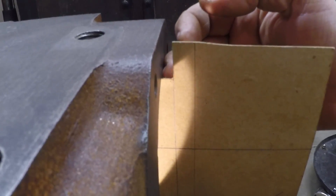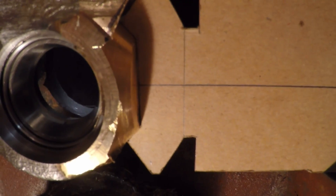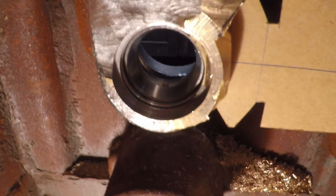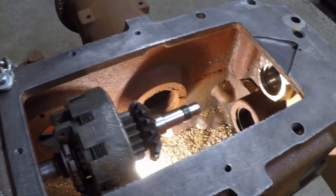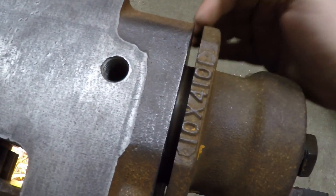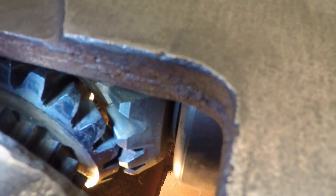I think it's about time to do a test fit. I've got the live power shaft with the PTO clutch loosely placed in, and my cardboard gauge in position — I can see some clearance between the gauge and the case, so I'm not quite where I need to be yet, but it's fitting pretty well where I have everything milled out for relief. I'd love to stop here and keep a nice thick sidewall, but I know that's not going to be possible. Getting the belt pulley housing in, it's still about a quarter inch out — and looking at the gear mesh, the gear tips are just barely meshing. Not even close to doable, so we're going to have to take out some more material.